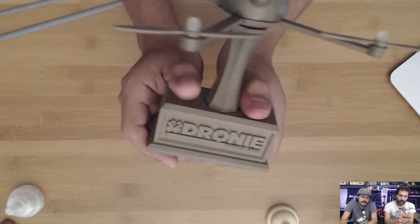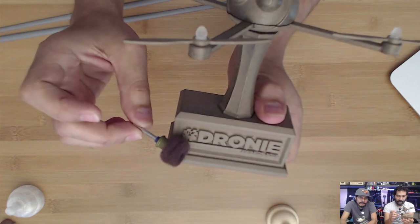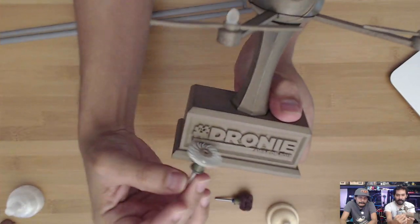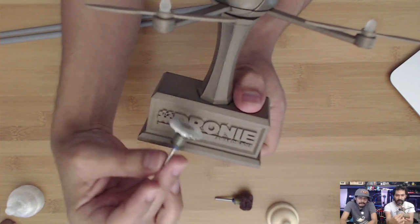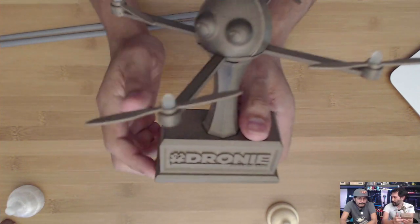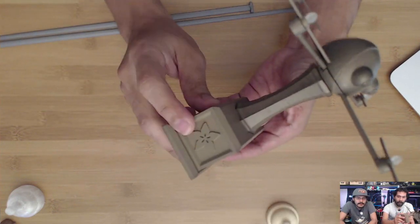That's really cool. Yeah, the tumbler is definitely the way to go for this type of polishing, because with the Dremel, there are just so many little parts in there. This would be a pain in the butt to try to get into all the little crevices, and you'd probably damage a lot of the sides. So the tumbler, using number 2 screws, number 4s to get into the nooks and crannies, is definitely the way to go. Yeah. Very cool.